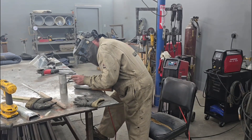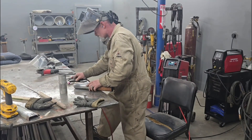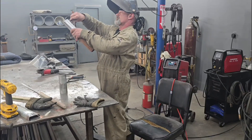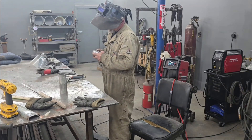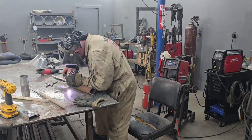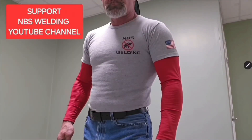I've got a piece of 1/16th inch stainless steel TIG rod and I'm going to tack it with the TIG. I've got the ArcCaptain TIG 200 set on DC TIG with a sharp 3/32 tungsten and argon gas. I tacked that 1/16th inch TIG rod onto my 2-inch pipe, and then I'm wrapping it around that pipe as an expander to make it just a little bit bigger in a way that I have a little bit of control. The next part is getting some clamps on that rod to hold it, then I'll put another tack on it to generally hold it in place.